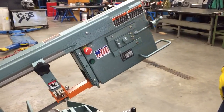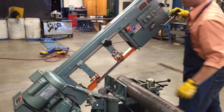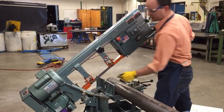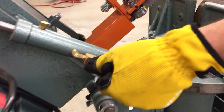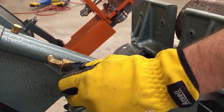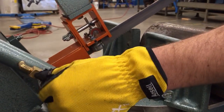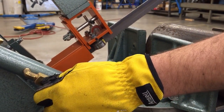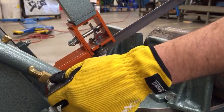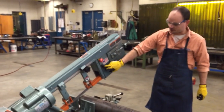This thing has an electric motor as a counterweight so it drops at a pretty steady speed. We can adjust that with this knob right here. If we turn this all the way in it basically stops it from going down, and then if we loosen it — counterclockwise — we can control the descent based on what this valve allows the cylinder to go in at. I'm going to stop it right there and then hit the start button.